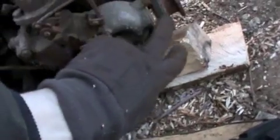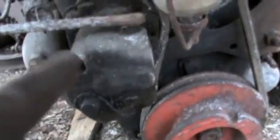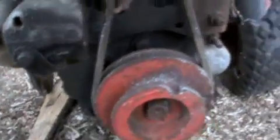And it's got the carburetor, cast iron rear facing one. It's got the aluminum elbow on the back of it with a little door, which is still on there, which is nice. And it actually has a Pierce governor on it. Oh yeah, and it's also missing the left wheel. Both of these are missing their left wheels, which is kind of odd, or left tires, whatever. And it's got the Pierce governor, which unfortunately, the little elbow that came up the top here was snapped off at some point, which I can always fill and probably put another elbow on it because I have a couple of extras.